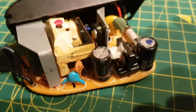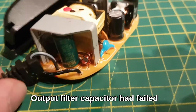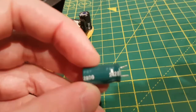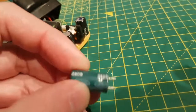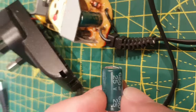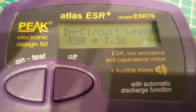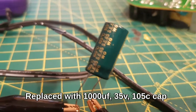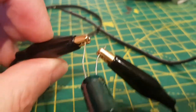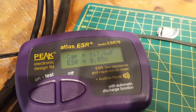This is what it looks like inside and the problem was this capacitor here — a 25V 680µF no-name 105°C cap. See the top is domed. Measuring in-circuit it's leaky at 7.3 ohms. I replaced it with a Sanyo 1000µF cap which measures 0.05 ohms, not 7.3 ohms — so that was clearly the problem.